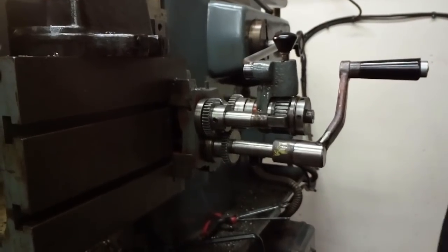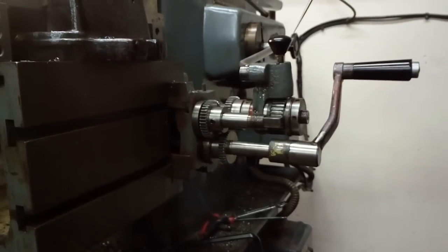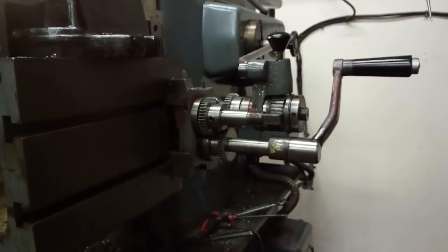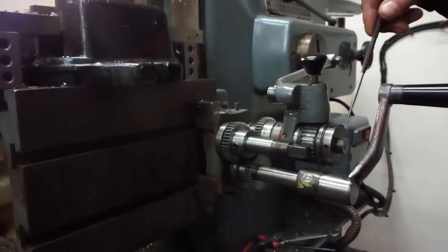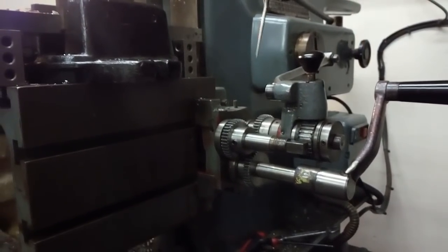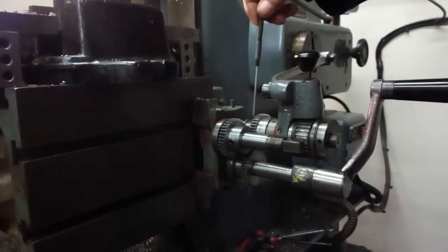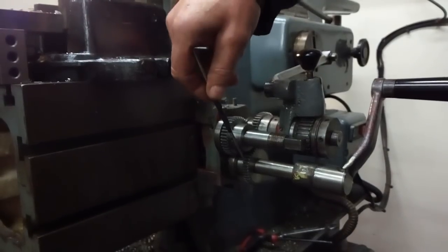These drives are very rare; in fact I've never seen one, so I decided to design and build my own. This drive consists of a third shaft which is in fact a static stub axle, and a drive collar and a driving gear which in turn drives either one shaft or the other shaft.